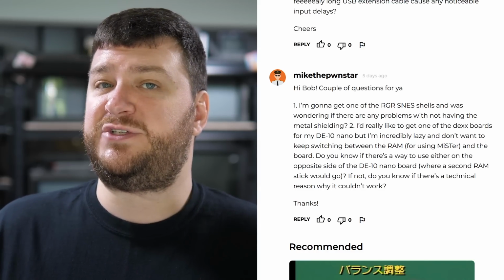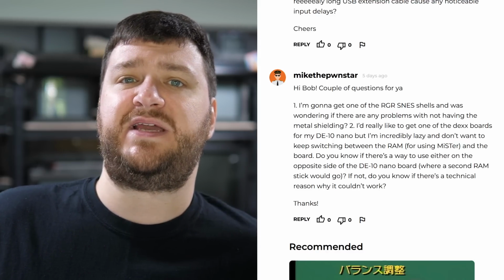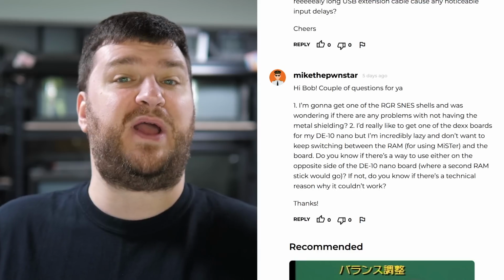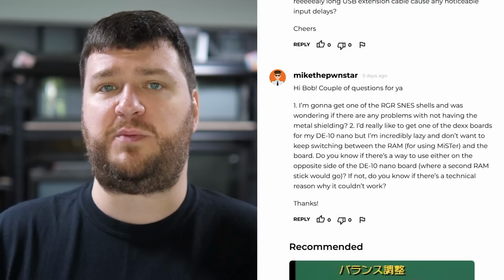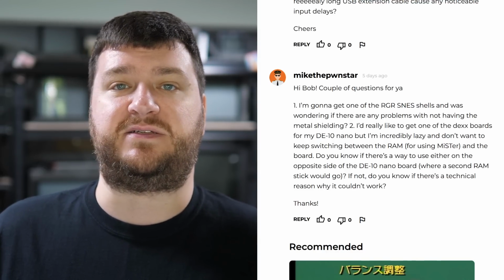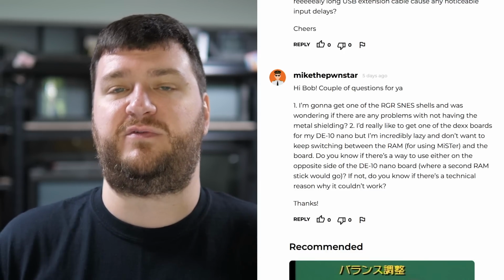And in the case of the Super Nintendo, I don't think I've ever needed it. Now, the PC Engine, and I think the TurboGrafx require that because they use that as the ground plane, but I think in almost all cases you don't need it. What I would recommend, for a couple of reasons, is keeping it because it's a piece of the console. If you ever decide you want to make it original, or if you ever want to sell it, you have the original stuff with it.